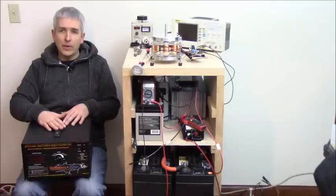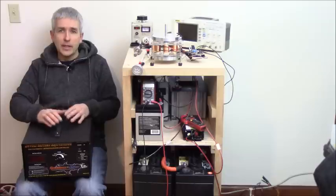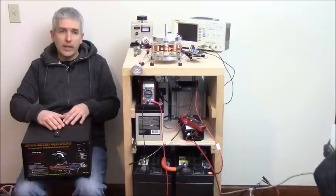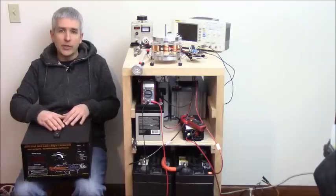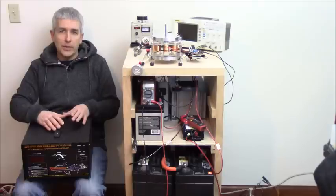So most batteries get sulfated and damaged over time, so that you have to replace them in 3 to 7 years approximately. They start losing their usable capacity right away. In fact, a battery that sits for even 4 months unused will start to sulfate and develop some sulfation buildup in that short period of time. So we recommend, I'm not trying to push a product here, but starting off this process with a clean battery.